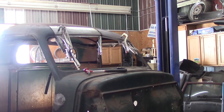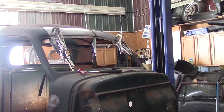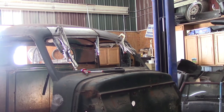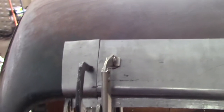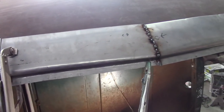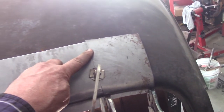Looks like I got that pretty much formed up and I'm gonna weld it in place — not the whole thing, because I'm gonna wind up welding both sides of those seams so I can grind one side off and have confidence it's not gonna break. The hard part is welding it without having it all deflect. So I got some clamps — you can never have enough clamps. Connor's got like 15 more clamped over on his charger, but I don't dare pull them off. I welded the two center pieces together because when I did these I didn't want anything moving around — I wanted it to stay right where it was.